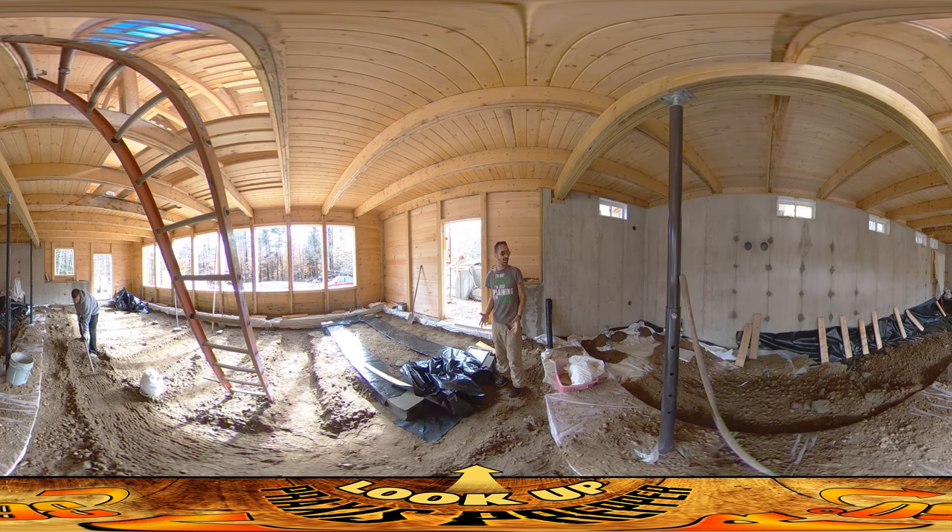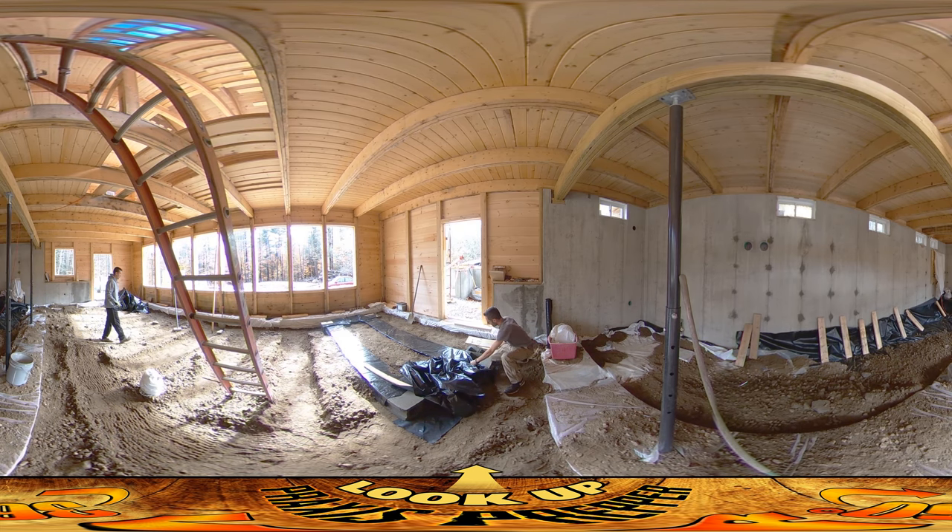The columns are laid on their side, and the idea is that we're going to be pulling air from upstairs, vented down through the floor. There's a little gap in the footing right here — air will come in from there and go into this cinder block, which is laid on its side. From there it goes into this little chamber, and there are all these little chambers that kind of have the tunnels splitting off in different directions.